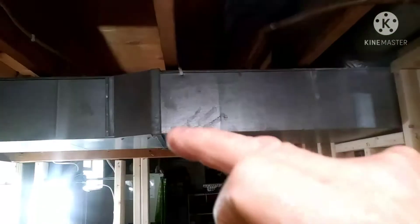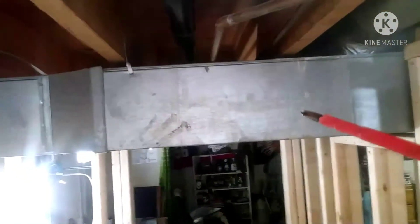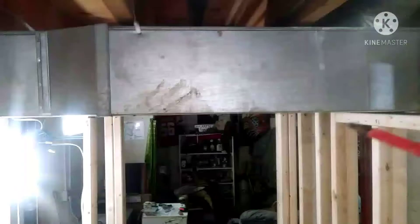So sometimes you just got to do what you got to do. I'm going to come down to this bottom edge and then straight across to the doorway. I still have some nailers to put in around the perimeter and spots. This half of the bathroom ceiling is actually going to get furred down so the drywall will clear these water lines. The drop around the other half of the bathroom will come down to that bottom edge and then straight across to the other side.